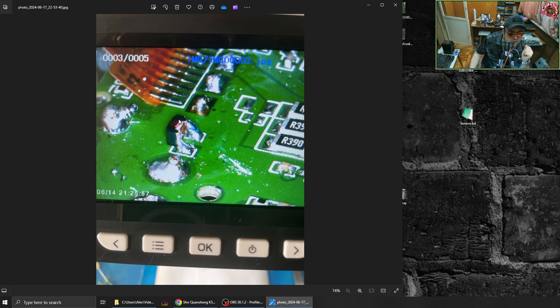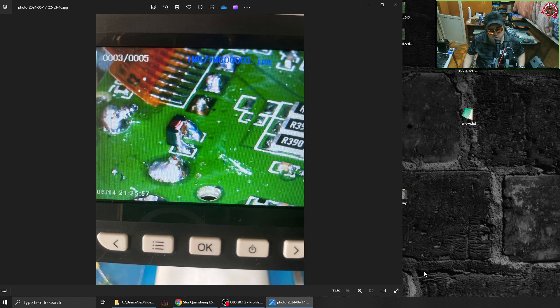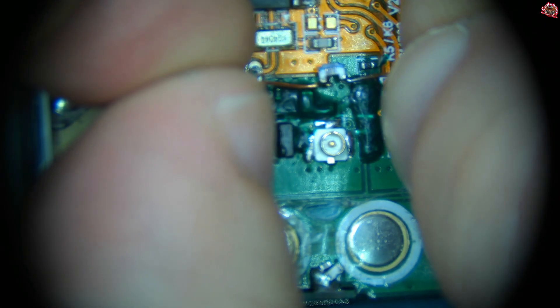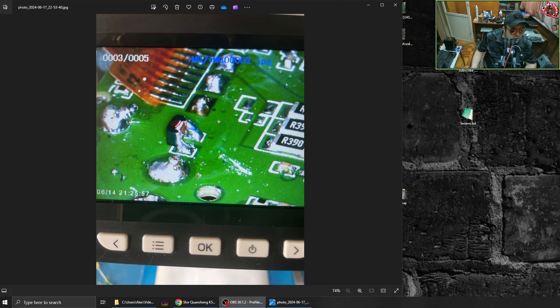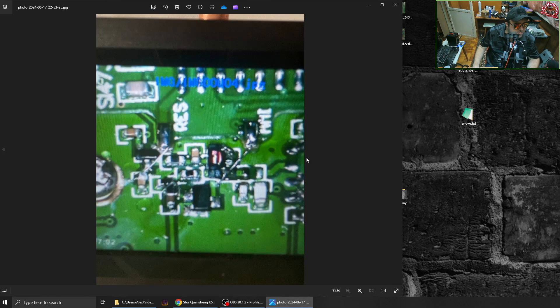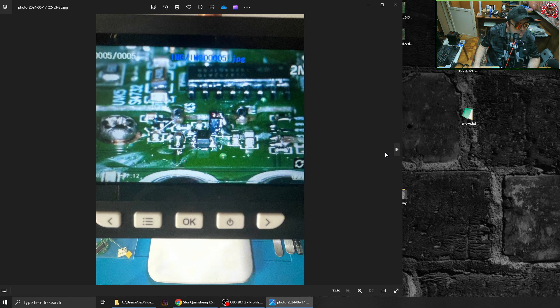As you can see, they put one of these SMD chokes sideways. Let me show you on the microscope — usually it goes like this, but they put it like this, sideways. That's what you've seen. So going back to the antenna-in and antenna-to-ground area, they put a modified, upgraded high-frequency low-ESR choke sideways. Nothing wrong with sideways — I guess it's easier for them to solder.